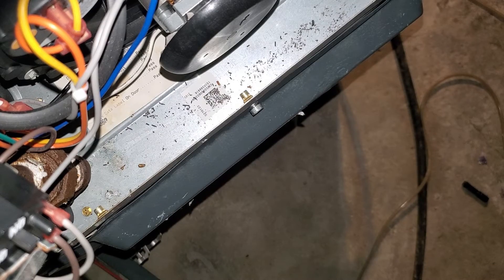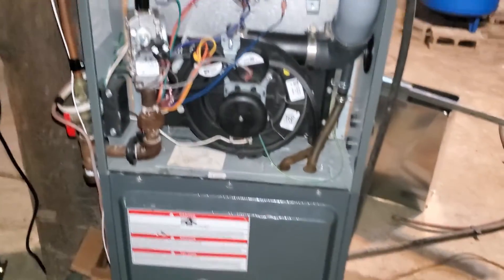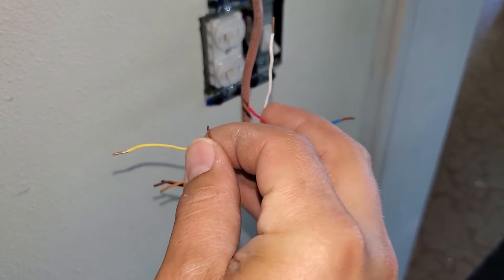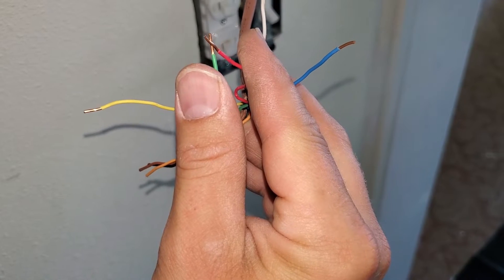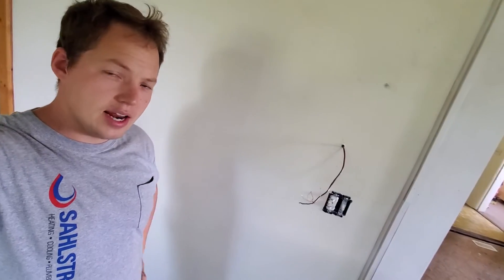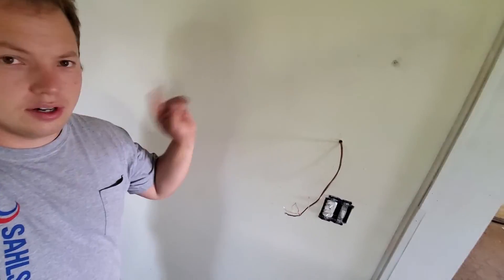I'll make a separate video actually covering how to use your furnace without a thermostat, but for now I'll just go show you guys really quick that it is working. So here we are with the thermostat wires again. You can see we have the red and the green — this is going to turn on the fan — so let's go ahead and cross these guys right here. There you hear the fan came on just fine. That's pretty much all you need to know for furnace fuses in particular. Click on this video right here if you want to see how to run your furnace and air conditioner with no thermostat. I'd really appreciate it if you guys hit that subscribe button right down below this video. Thanks a ton, and we'll talk to you right over there.